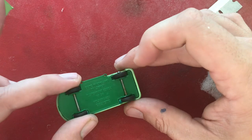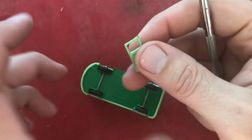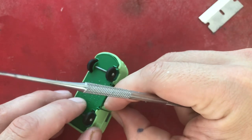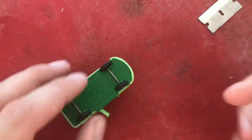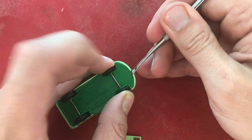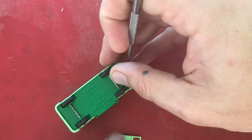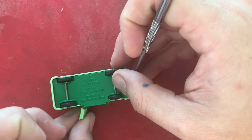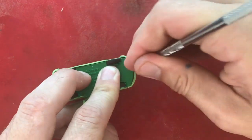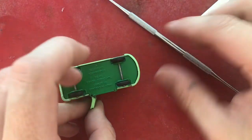The base came back together beautifully — all the little surface nicks and cracks are gone. I was able to retain the original paint on most of the interior and touch up only the spots on the base that were really damaged. The original door I found on an eBay auction. When I put it in, you can really tell how close I came on that color match — I can hardly tell any difference between the original unpainted door and the restored casting. For reassembly, I'm doing it in reverse: starting with the deeper tab at the rear, then using a dental pick to pry out the upper casting and get that little tab to slot back down. This feels like I need four hands.